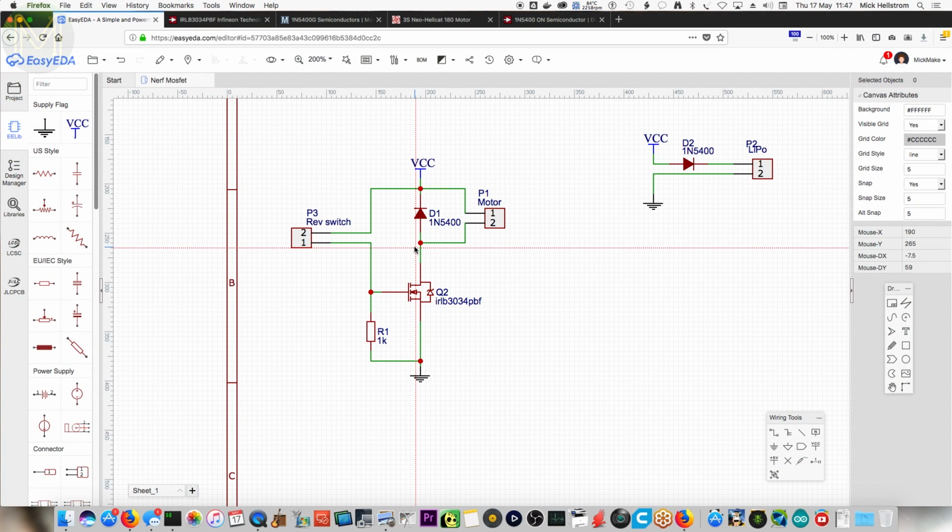You can put the PCB there. Yeah. This is one of the things that you do when you're designing a PCB: you want to put in components that can be replaced by something else. So later on, if you discover a design flaw, or some other issue, or if a component becomes obsolete, you can replace it with something else. Yeah. So there's always these trade-offs between selecting the component and future-proofing it as well. Yeah. And space and all that sort of thing.